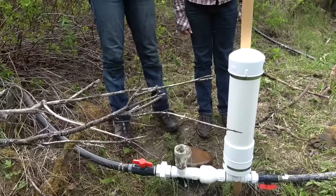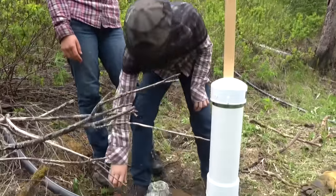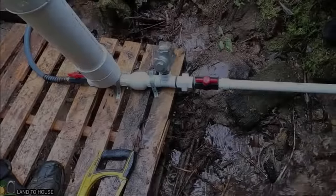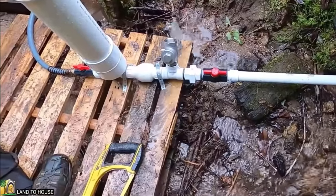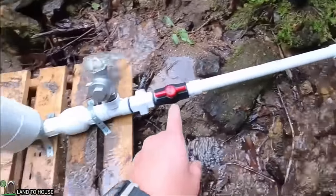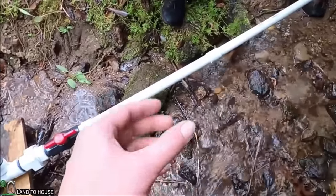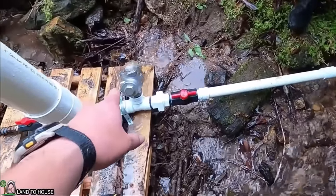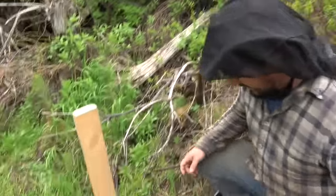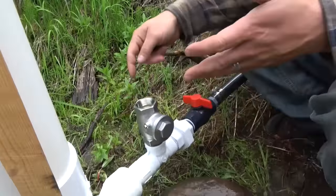As soon as I got excited, it just wants to disappoint us. We're going to talk to the boss. So oftentimes there's air stuck in your drive pipe, and you have to hold the valve down until that air is out. Water's coming down your drive pipe, slamming this waste valve closed, and sending a pressure wave back up the pipe. If that pressure wave finds an air pocket, it's going to think that's the source, and it will return to the check valve and just cycle faster and faster until it stops. To get the air bubbles out, they should flow out as long as it flows fast enough, but coming up through this thing, it's just not that fast, even if you hold it open.